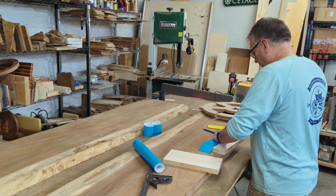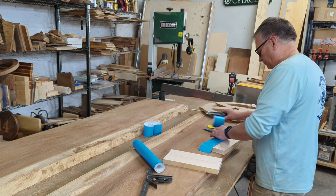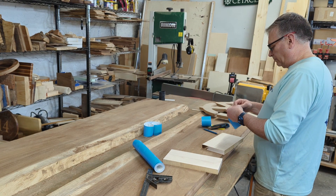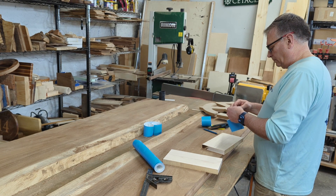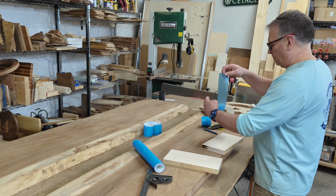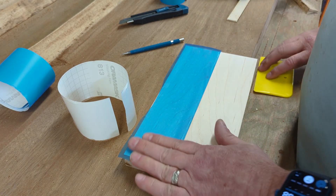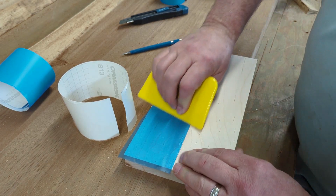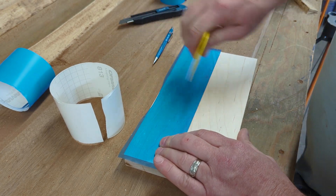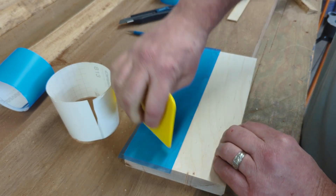To start, prep your wood by planing it flat, then sanding it to a smooth finish. For CNC milling, you want to mask the project — a plastic sheet film works well for this, as it will prevent the powder from adhering to your entire project. Cut the film to size, then peel off the back and place on your wood. Use a plastic spreader to push down on the wood and remove any trapped air bubbles.